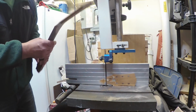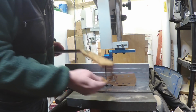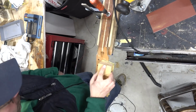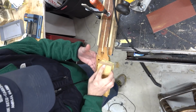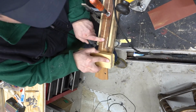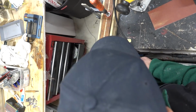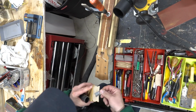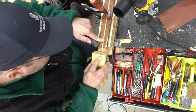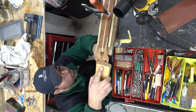and it went pretty smooth, but a little bit scared. This was a little risky, but I got it off, and you can see the mess that I've got underneath that faceplate. The Bondo was a significant problem. So then after I cut, the headstock wasn't perfectly cut, so I've just got to sand some of the side down so that it's flat. The headstock had a little bit of a twist in it from the wood, and so this will get it flat. And then as I glue on the back strap and the new headstock plate, it'll be perfectly fine. But this is just cleaning it up to get it nice and level.